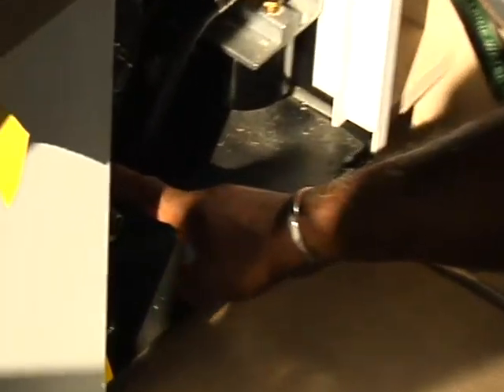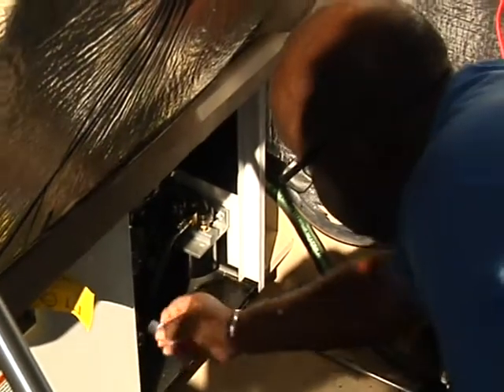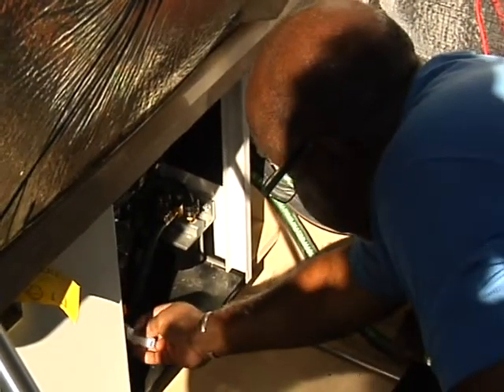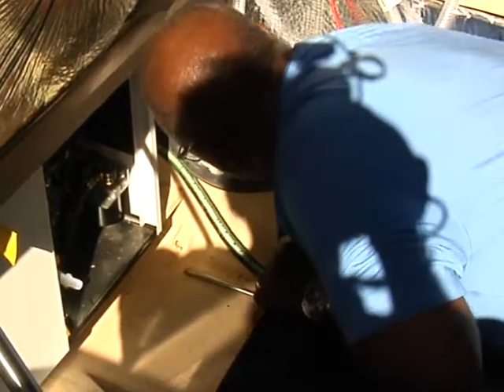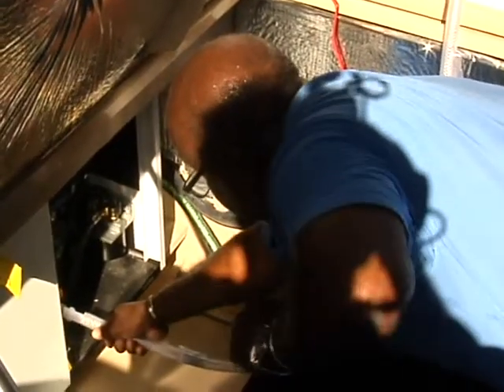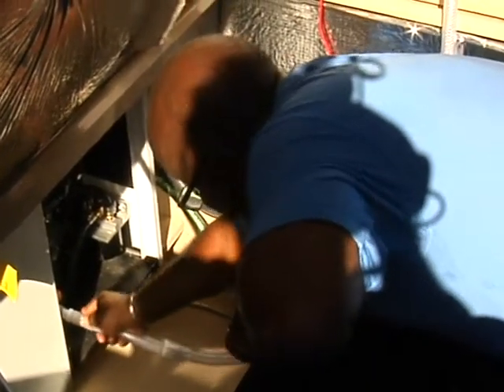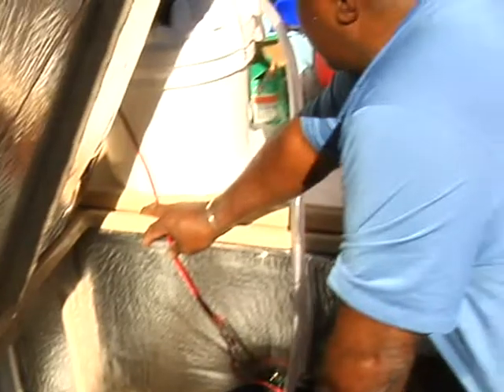This lever right here is the valve to the sump. You're going to need a 3/8 to 1/2 inch nipple or 5/8 inch nipple — you just screw that right into that. I've got the new fitting in, and I've got my oil pump set up with a different hose so I can reach down in here. Just install that right on there and turn on the sump.